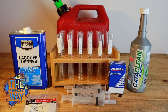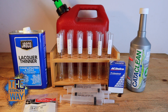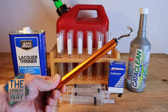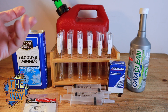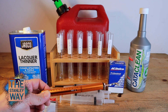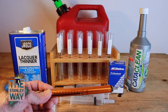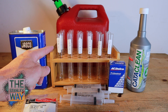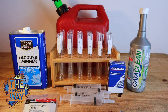I'm a little more scientific this time because I'm actually going to do some gas mixture ratios and I've got some syringes to help with that. Last but not least, I've got a spring scale. On the last video I pulled the o-rings apart to show how much damage was done — they got weaker and a lot of them got more brittle. We're going to test brand new o-rings to see what spring pressure they break at, then test each individual mixture to see how it weakens them.